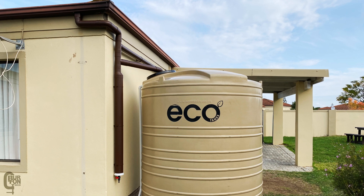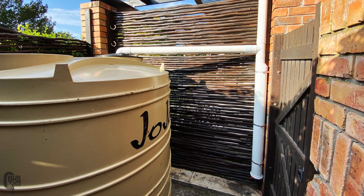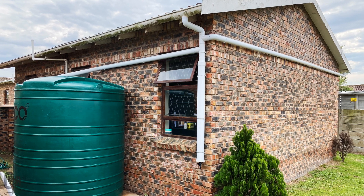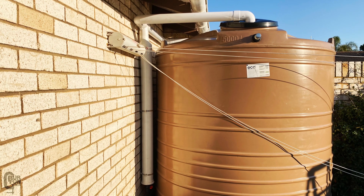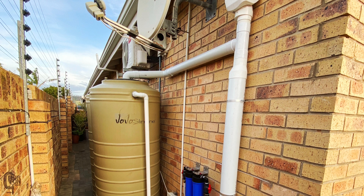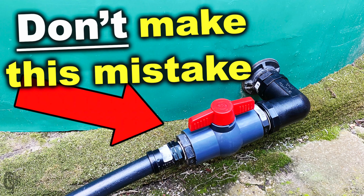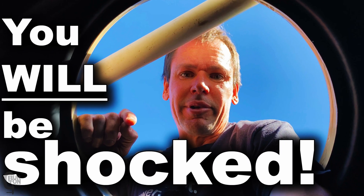How big should these systems be? Simply put, the bigger the better. This all comes down to how much pollution is around your catchment area - your roof - and the intensity and frequency of your rainfall. Most systems I've seen are way too small, even the ones in this video are probably a little on the small side, but it's what could fit at each location. For best results you'll have to experiment with your exact setup to get it working effectively. Please remember, while these systems don't prevent 100% of the dirt and nasties getting into your tank, they do go a long way to keeping your harvested water nice and clean. There are also a whole lot of other rainwater harvesting related videos on the channel. If you enjoyed the video, please give it a thumbs up, leave a comment, and thanks for watching.